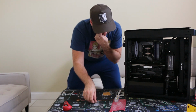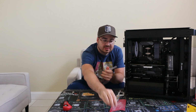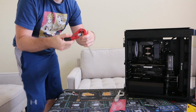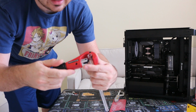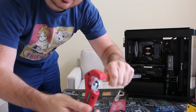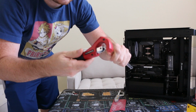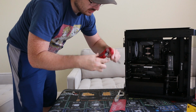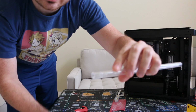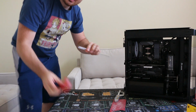Now, when you're cutting acrylic, you can't do that. Watch, if I try to use the pipe cutter, what do you guys think is gonna happen? Remember, acrylic is similar to glass. So what do you think is gonna happen once I start turning? You hear that? That is the pipe cracking. Now I can't even use that. Let me give you a close-up look. You see that crack right here? That is cracked. So I can't cut with the pipe cutter like this.